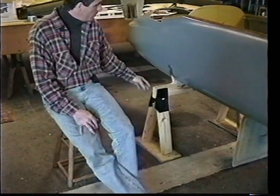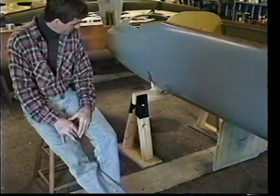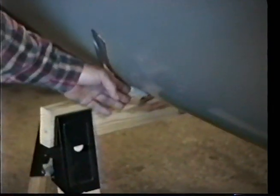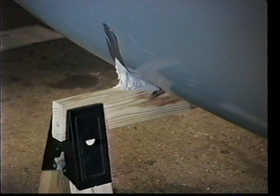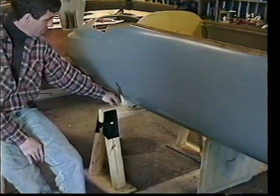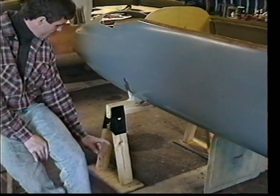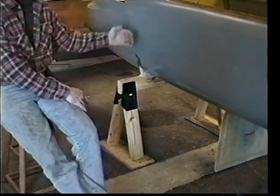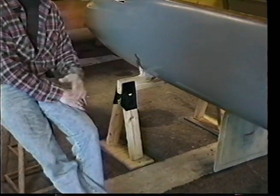After having done so, we leveled the fuselage, got everything straight, and then put tape around the corners on all four positions, and then took pieces of wood and/or Bondo and shimmed between the fuselage tape and the sawhorses. When it cured, we drilled holes 3/8 of an inch in diameter and then ran drywall screws through the fuselage, through the Bondo and into the wood, tying into the wood. Now when we want to remove these things, he ran some paint around the perimeter so we can unscrew the sawhorses from the floor if we wanted to and replace the whole thing, or we can remove the fuselage from here by virtue of the fact that the Bondo will not stick to the silver tape. So we can move this thing quite easily.